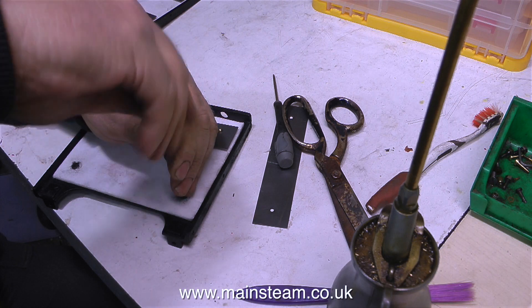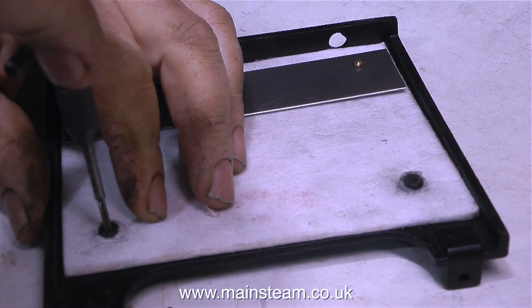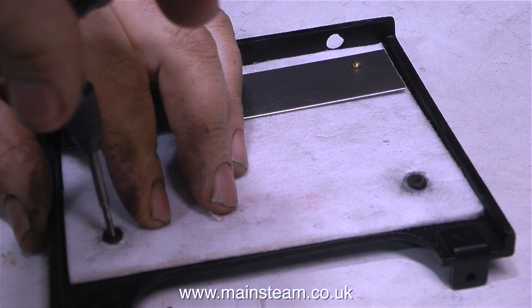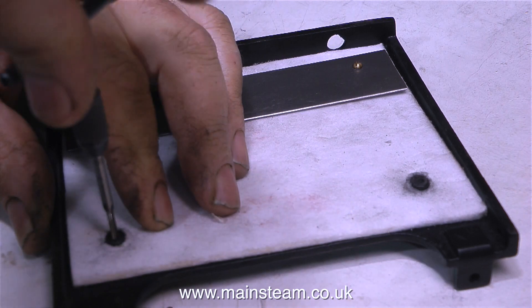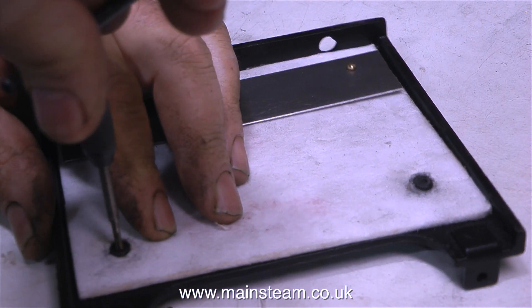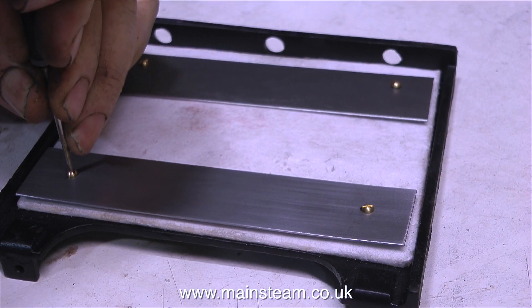For instance, at the moment I'm fitting these thin metal plates that hold the heat insulation in place. And can you believe it — two of the holes hadn't been drilled or threaded. In one side they were, in this side they weren't, so I drilled and threaded them. This is a 7BA tap going into the hole and I'm being very careful not to break off the tap. I didn't paint these parts because the original parts weren't painted and they seem to have survived for many, many years.